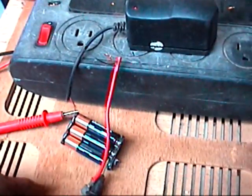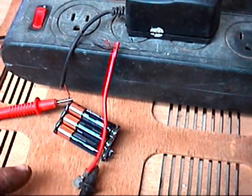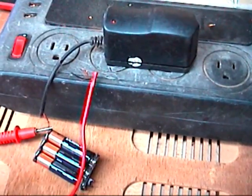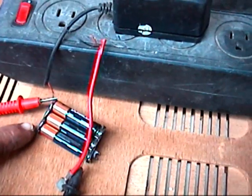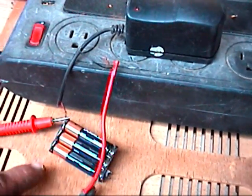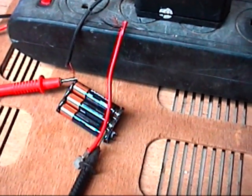I like to use these little battery bank holders to connect multiple batteries, because you can't really charge one of these batteries with one adapter — you can't easily find a 2 to 3 volt adapter. But 5, 6, and 8 volt adapters are a lot easier to come by. So if you get a battery pack where you can put 3 batteries in series, it's a lot easier to find an adapter that can charge all 3 at the same time instead of just one.